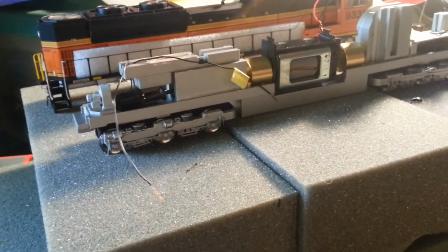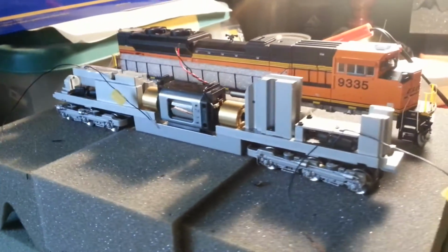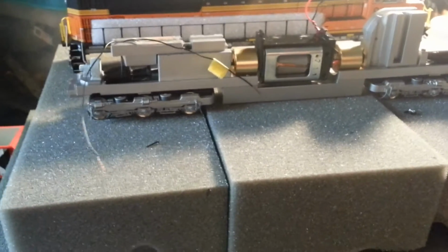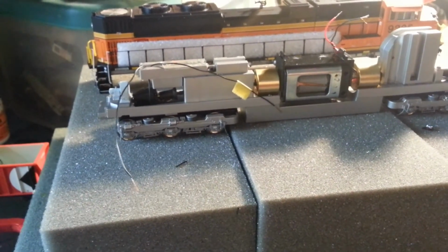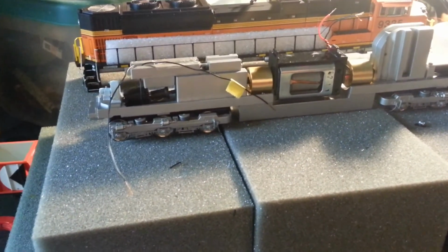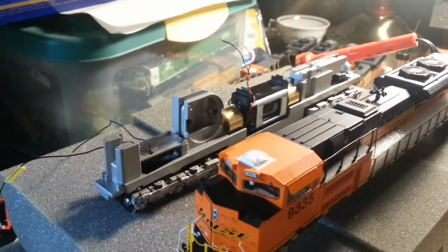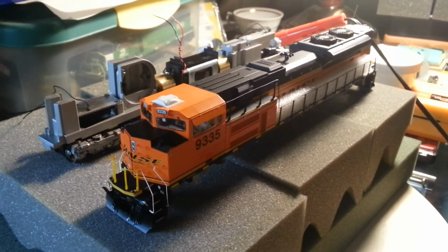I find it kind of comical that they messed up on this, because this could actually hamper performance severely if just one truck is operational. Actually, I've done that before by accident. Well, not cut the leads and connect them, but they weren't connected. Long story. I'm trying to make it as short as possible. I used those little black tabs to connect the leads to the decoder, and the leads weren't connected very well due to those black tabs. So I stopped using the black tabs and I just solder straight to the decoder, which is much more efficient. And I'll show you that as well. So what's coming up? Next thing will be to install the speakers and the decoder. And that's the part that everybody's been waiting for. So everyone stay tuned to Build 02.